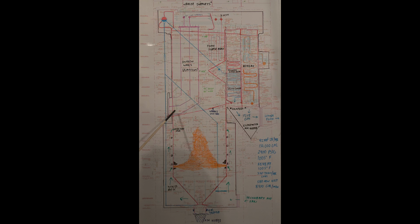So the radiant heat, these work better at low loads. The heat load stays fairly constant here. At higher loads, your back superheaters will work better. These require a lot of steam flow to keep them cool. There are certain loads in the boiler we really couldn't run at due to the steam flow versus the temperature in the firebox. All these tubes here are cooled by steam.